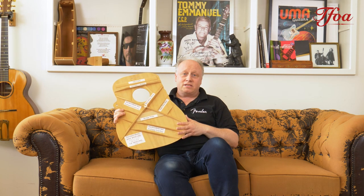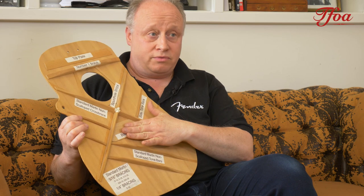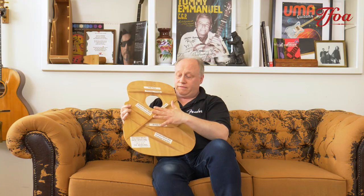Now we're coming to the modern era, and we have to thank Mr. C.F. Martin for introducing us to the X brace. This is Martin's basic X brace pattern — the main cross bars form an X, with the bridge plate underneath the bridge. We also have a transverse brace underneath the end of the fingerboard to stop the neck pulling down the top. Martin really brought to the forefront the idea of thinning the ends of all the braces. If you think of throwing a stone into water, where it hits you get the largest waves, and further away they get weaker and weaker.